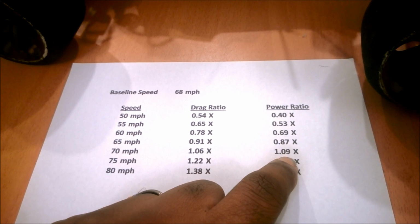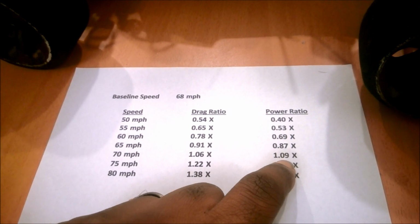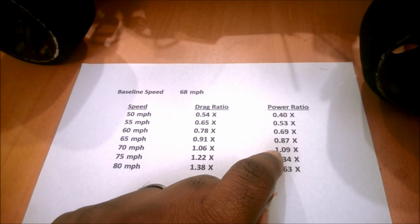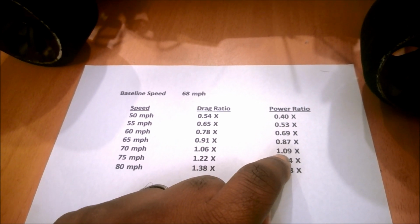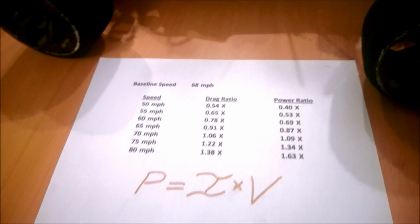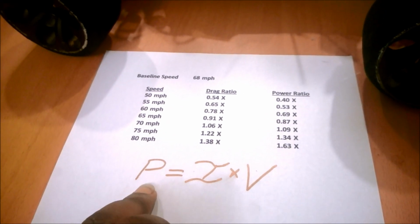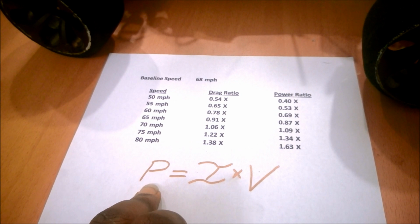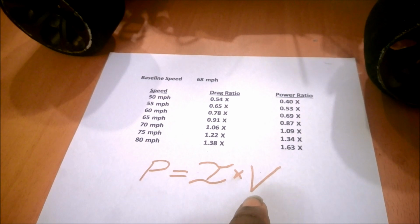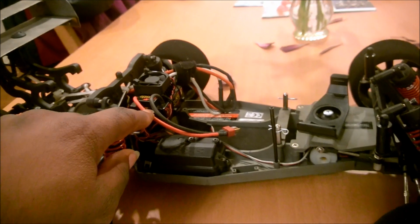So if I'm maxing out 1800 watts, which is roughly what these power systems with 3S at 12 volts will give me, 10% on top of that is another 180 watts. That's a lot of extra power. Now, again, we've seen that the voltage is dropping significantly, which means the current is kicking up, but still, in order to do the speeds, you still need the amount of power to be supplied from somewhere. And I think that I'm hitting the internal current limit of the ESC.